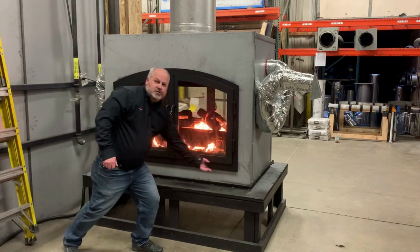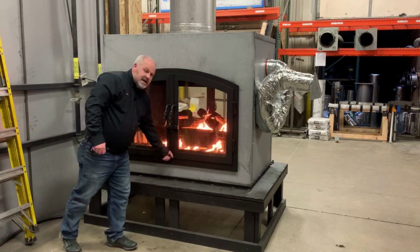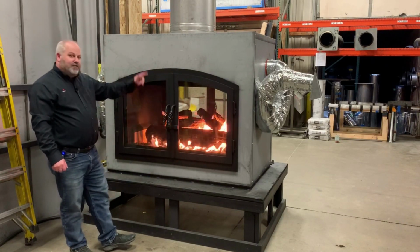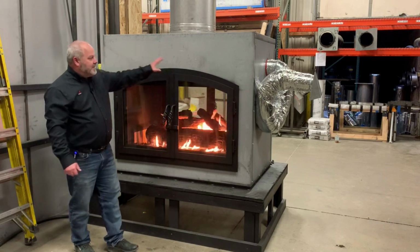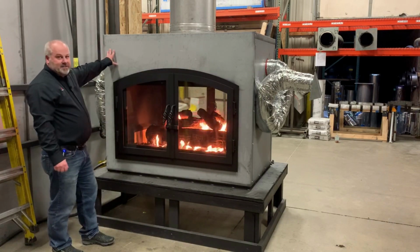You notice there's no air controls on the backside, and that's for a reason. We move the air controls, which would normally be here for controlling the air on this side, to the inside, because that was a spot where you could get cold air moving through it. We can't have that. So again, sealed up fireplace on all sides, combustion air ducts, insulated panel system.